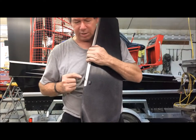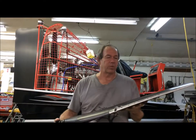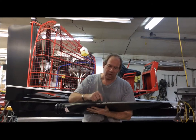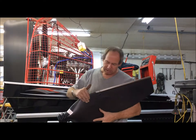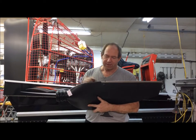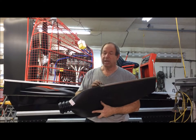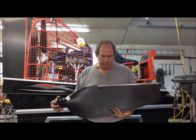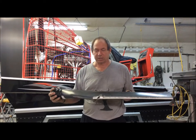You can see it entered here and came out there. These are normally repairable if it only hits one side, but when it goes right through, that's called FOD — foreign object damage. If it breaks this side and that side, the manufacturer will not fix the blade, but if it only goes through one side, it is repairable 99% of the time.